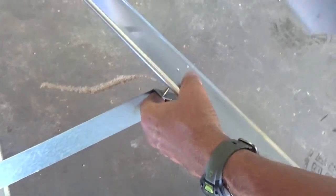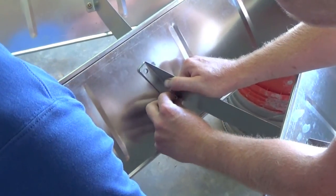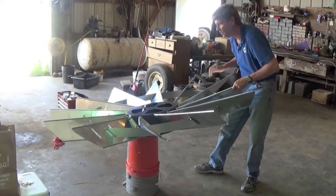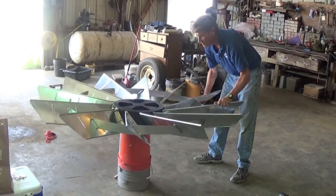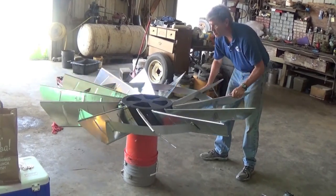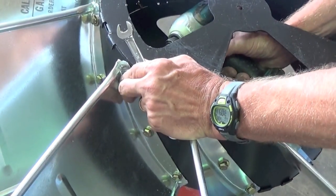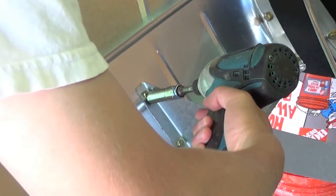Repeat the process until all blades are installed onto the hub assembly. After all the blades are in place, install the blade braces between each blade. You'll need to pull the blades together to get the last two bolts to connect — it helps to have an extra set of hands for this step. After the head is assembled, we recommend flipping the head over and wiggling it back and forth so the blades settle into about a 10 to 15 degree angle facing upwards. This also makes it easier to get a wrench on the bolts for tightening. Begin tightening each of the bolts and nuts inside of the hub assembly — an impact wrench or air wrench can significantly speed up the process. Once that's done, tighten the bolts and nuts on the blade braces.